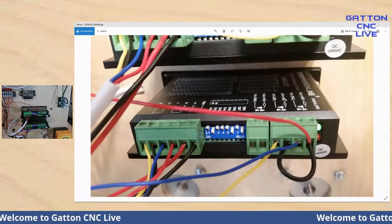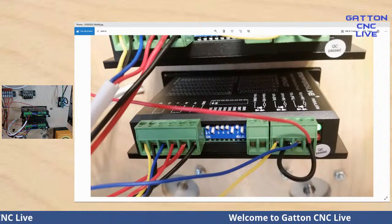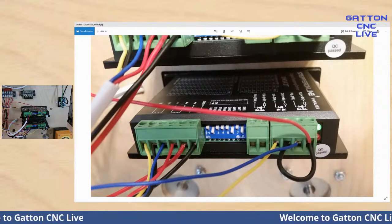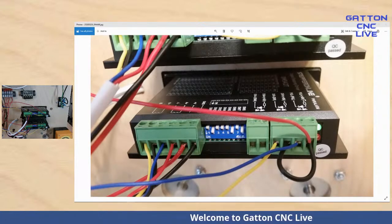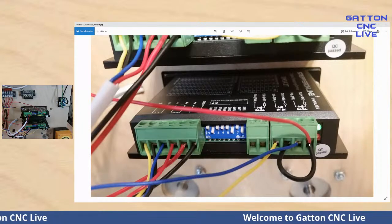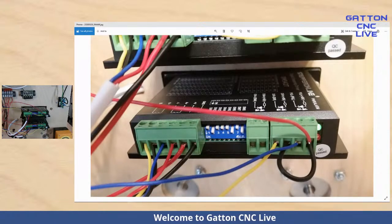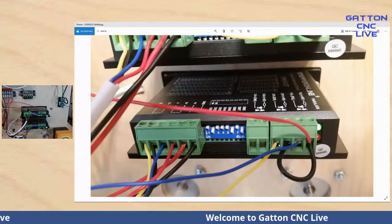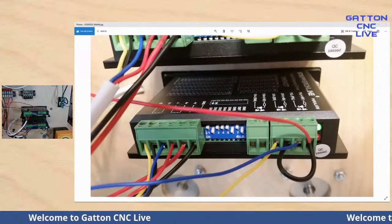And then over here is the direction 5 volts. And what I've done is I've taken a jumper wire, again, just a little loop, and spun it around where I'm connecting both the plus 5 volts for the pulse and the direction. And then I'm taking this wire, and I'll show you where it goes in just a minute, but it's going to go to a five volt terminal. So here I've got the yellow is the direction, and the blue is the pulse.